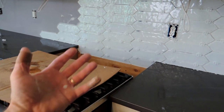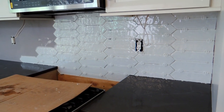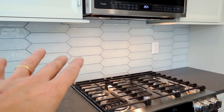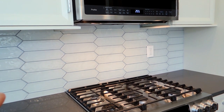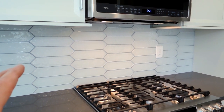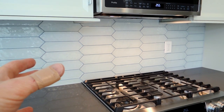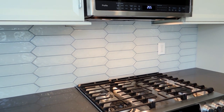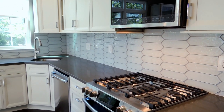As you can see from my fingers, it is glass and it can cut you. As you're cutting on the wet saw, you get little chips here and there and they tend to get picked up by your fingers if you're not careful. In this case, the homeowner chose a urethane grout — it actually has sparkles in it, like glass beads. Once it's grouted, you can see what it looks like. When you grout, if you're using a sanded grout, you've got to be careful because it's glass and you don't want to scratch the surface. Typically you'll use an unsanded grout, or in this case a urethane grout with glass beads that does not scratch the surface. The pattern is all complete here with a silver sparkly urethane grout.